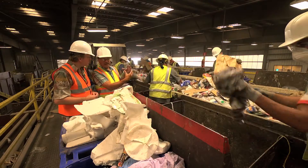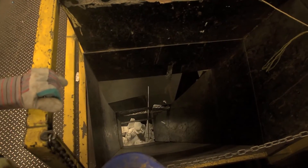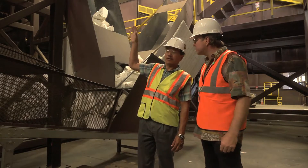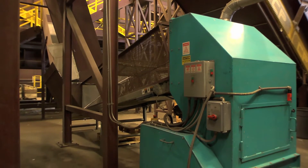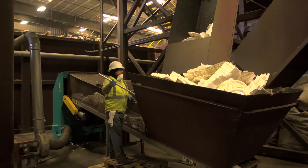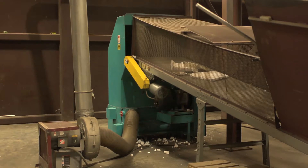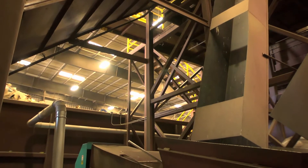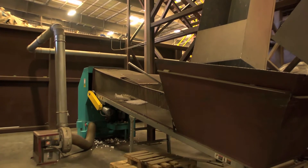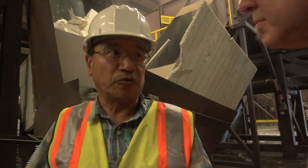The foam is actually retrieved from the sort line above. It's then placed onto the hopper, and it comes down onto the infeed system that is then fed to an oversized grinder we purchased along with an oversized blower to cut down on the labor cost. The grinder has blades inside the hopper that grind up the styrofoam and then takes it through this tube to the blower, blowing it through the tube you see above. The line and grinder are situated under the sort line — that was formerly dead space we were not utilizing.